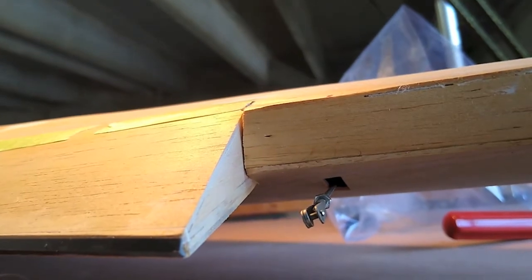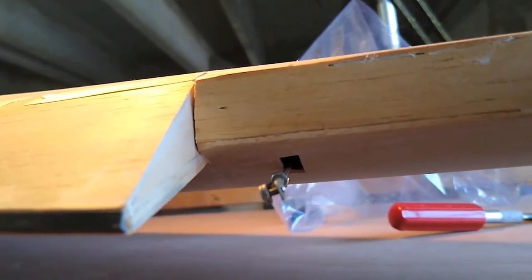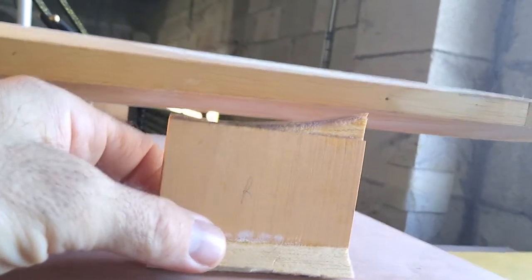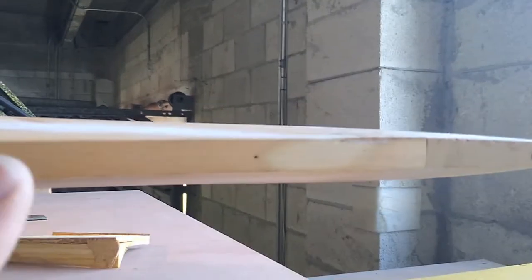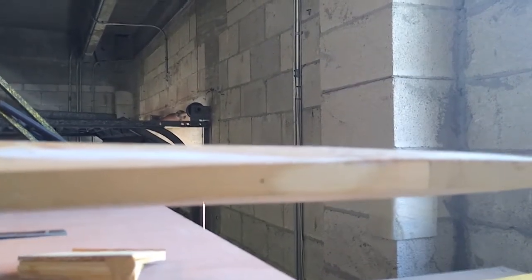So what I need to do is build another rib. I don't remember if it was right here or not — I have to look at the pictures. I'm going to put a rib there to steady it. It's going to lay flat on the center section, then come out here — that'll be the jig. I know that these things I built are proper, where they're supposed to be. It's a quarter inch of washout at the tips on each side — I checked the plans. I could literally build all of this into the ailerons to correct it if I want. I may have to, a little bit.